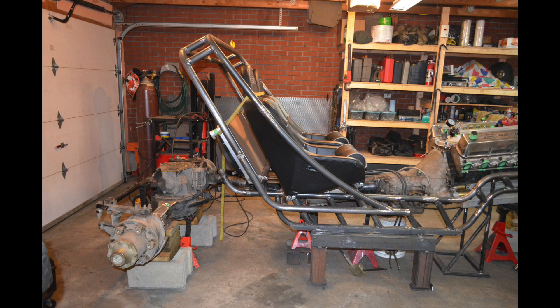My pillars are canted back quite a bit — I was going for an old-school muscle car look, with a raised hood and a very slanted-back B-pillar. This is all a matter of preference; you can make it straighter if you want. But remember: the more the A-pillar or B-pillar leans down, the more support you need to add to it to handle a hit from the top.